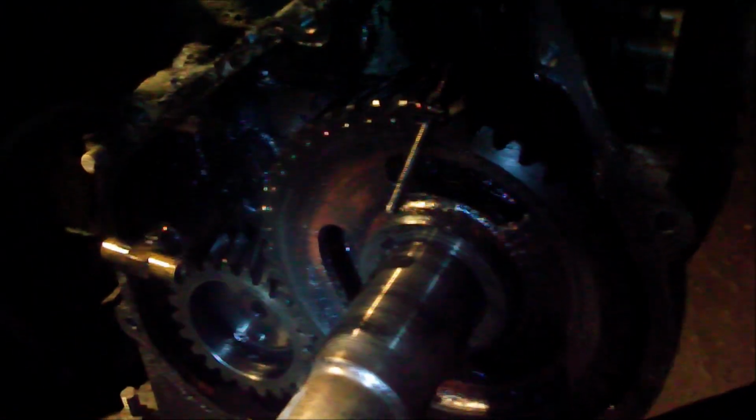So yeah, got the governor out. I ain't gonna pick it up yet because I ain't got gloves on now. But that's inside the back. It's quite gungy in there where the oil hasn't been flowing back properly. But I'm gonna clean that out and get the other governor, and we'll fit the other governor and it should be good to go. I'm gonna make a little video clip in a bit of setting the valve clearance, because the valve clearance is out. I've also dropped the oil. As you can see, not a pretty sight, really. So what I'll do now is flush the sump with a bit of paraffin, clean up the back, and get the governor out of the other engine, and we'll see how far we get.